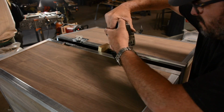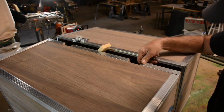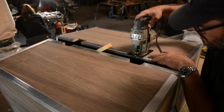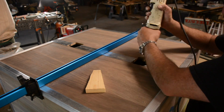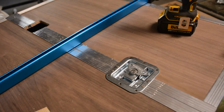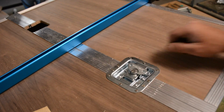If you just, everything sort of dictates what shape it should be, the cutouts that should be. There really wasn't any special instructions that I followed. I just tried to make sure that every cut I made was not going to become exposed outside of the flange, and so I made it really tight. In this case I had to use the die grinder to get it to seat in there nice and flat. And I'm using 1/2-inch flathead screws that I have.